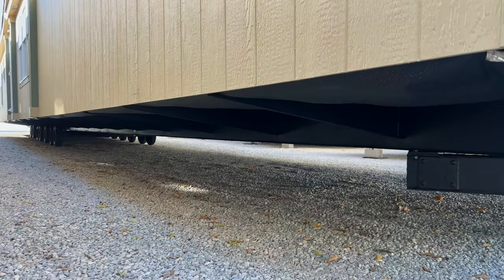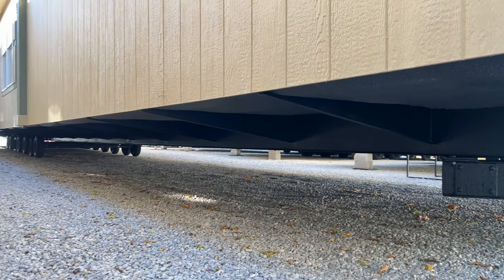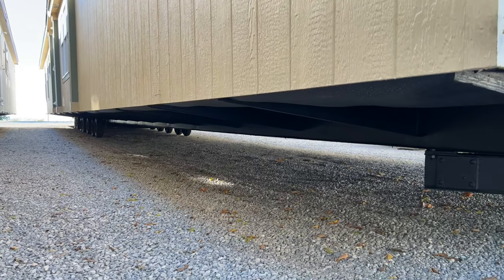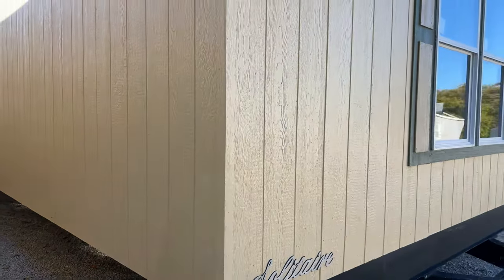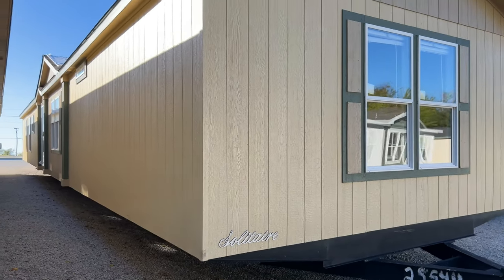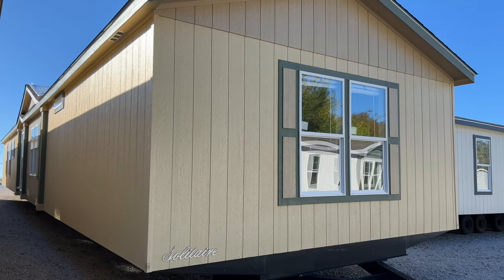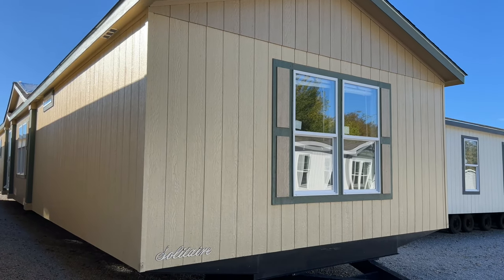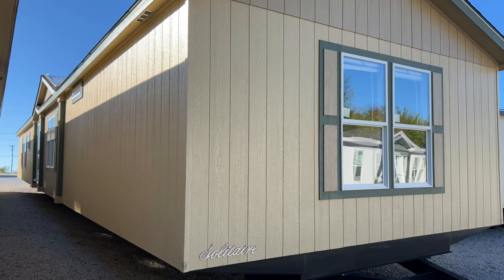With the Solitaire 18 wides, something unique is that these outriggers are going to be every four foot on center, as opposed to every eight foot on center. So you're going to have more support on this house holding up the sidewall. Since it is wider, it does have more pressure on those outriggers, so we're going to want more of them. Another thing unique about the Solitaire 18 wide is that the floor joists go to a two by eight, instead of two by six.